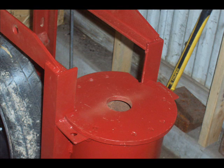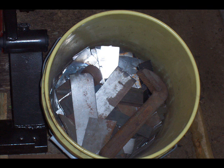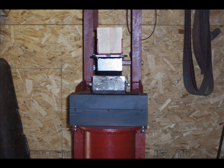Now on the anvil post I welded the top plate on, which already had a two-inch hole in the metal — being that it came from a PTO clutch. That allows us to stuff it full of steel clippings I've saved up and fill it with sand at the same time, and then the die block will be bolted on top of that.